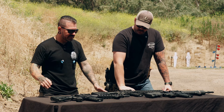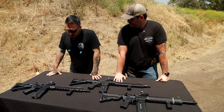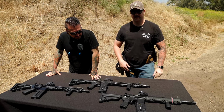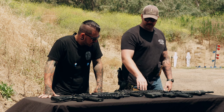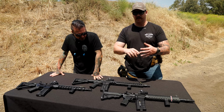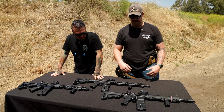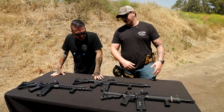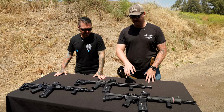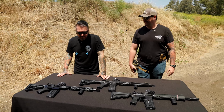You will be able to take your handguard off and work on your gas block, but if you ever need to take it off, you're not going to be able to. Well, you will. But you ain't taking off your barrel nut either. If you want to take off your barrel and your barrel nut, I don't know why you would, but if you are so inclined to do so, that gas block sits on top of that barrel nut, which means that when the barrel nut comes off, the barrel's one unit: gas block, barrel, and barrel nut. You're not getting anything else off unless you break the weld on this, which has a higher probability of stripping the threads than I feel comfortable doing on like a $700 barrel, personally. Yep. Because the Radian barrels are super expensive.